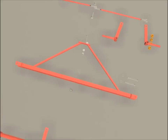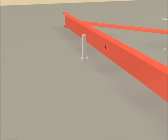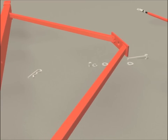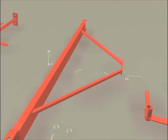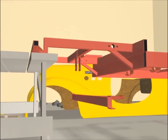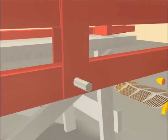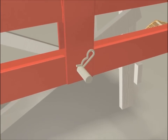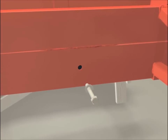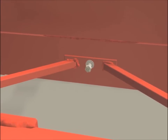You will start with the front axle. The front axle will consist of a pin, cotter key, two washers, a nut, and a bolt. The front axle will be put between two brackets located on the frame using a pin, a cotter key, and a bolt in the back of the axle to hold the axle into place.